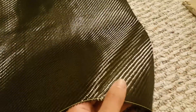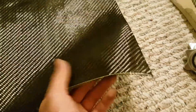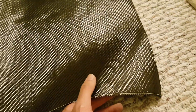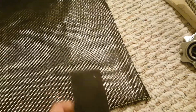This is carbon fiber — it comes in a woven cloth made of really thin strands of carbon woven together. Carbon is a really strong material in terms of tensile strength — if you pull these strands, they're very strong — but it's just a cloth right now, so you can't do anything with it. To make a functional carbon fiber part, you need to soak multiple layers of this cloth with resin. The resin is basically a really hard plastic, and when you soak the carbon fiber in it and it dries, it becomes really hard.